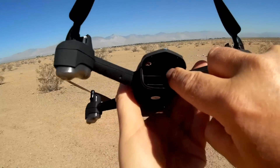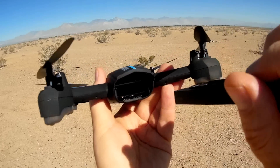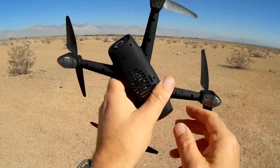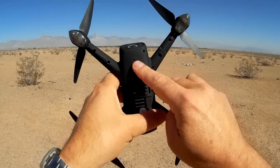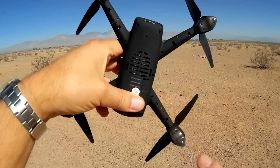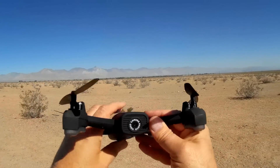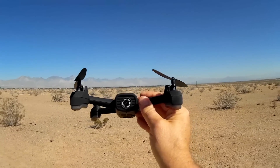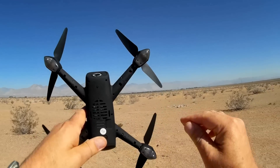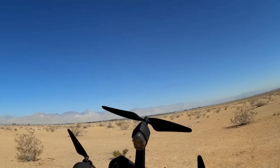The GPS is toward the back here, and the bottom of the GPS is covered with foil — properly covered with foil, that's good. We have an on/off switch here. This drone has a micro SD card slot, so you can record directly to a micro SD memory card instead of recording to your phone. That eliminates any Wi-Fi lag or frame dropping that you normally see with drones that record to the phone only.